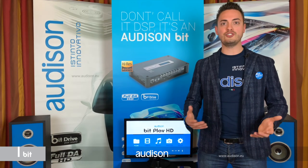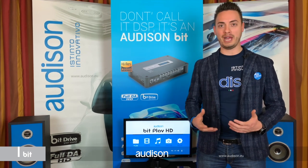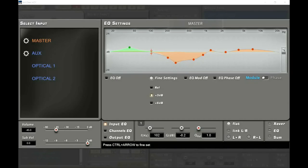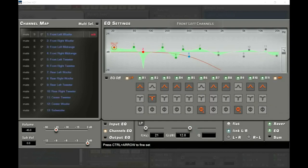The sound tuning adjustments have been improved for the most demanding sound experts. First, the EQ section is bigger, making tuning easier. More EQ bands have been added, up to 29 parametric poles available per channel through three separate equalizers. All-pass filters have been introduced, very useful for matching the phase response between active speakers.